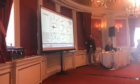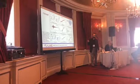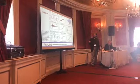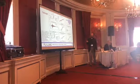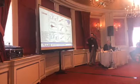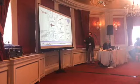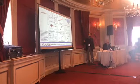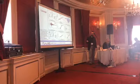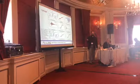Now, the force deformation we have here is, as I mentioned, a full-scale response obtained from a full-scale building. We can obtain the deformations of this hysteresis response with respect to time and scale it down, so we can input it again into the test specimen. Here we are applying a dynamic load, including the strain rate at each time step, and applying that to the test specimen again after scaling down the parameters.